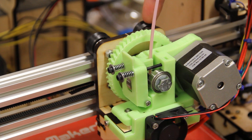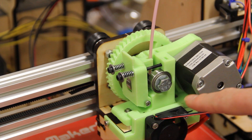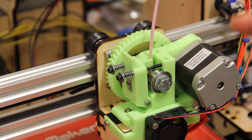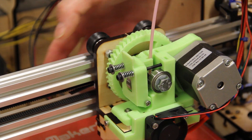As you can see, the top part has these two Delrin wheels right on it, and there's a third one right at the bottom of the X-carriage that has an eccentric shaft on it, so you can turn it with a wrench. What that does is move the wheel up and down a little bit so you can adjust the amount of tension holding the carriage onto these two extrusions right there.